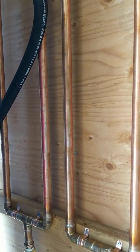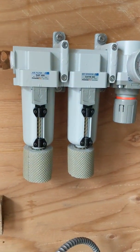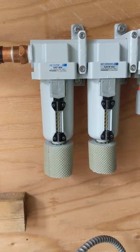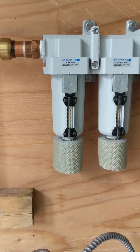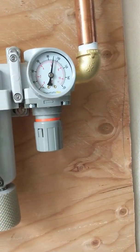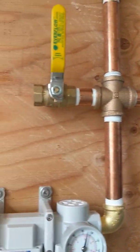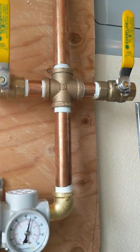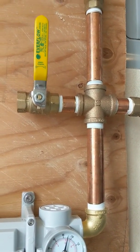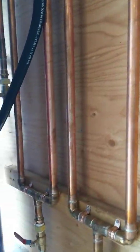All of this is three-quarter inch copper pipe going into the filter bank. This is a Pneumatic Plus unit — max operating pressure of 150 PSI — with a particulate filter and a water separator, plus a regulator. You'll see it's holding right at 90 PSI where I have it set. Coming off of that it stays three-quarter inch, and I put a couple ball valves there in case I want to add more lines — for a paint booth or a plasma cutter in the future.